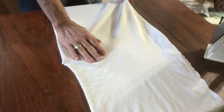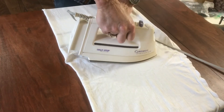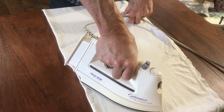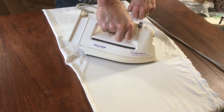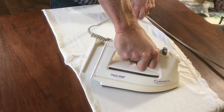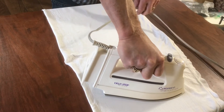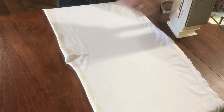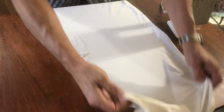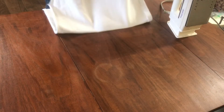Now this is the other table, and this is a different type of finish. I'm going to start at a medium speed on it, since I thought maybe we'd get closer to where I was on the other table. It was a pretty heavy water spot on this one, and we're making about half a dozen swipes on it. Now pay attention — when I pull this cloth up, you'll see it's actually starting to stick to the finish. You can see in the center where the cloth is kind of peeling back away — it was actually starting to stick to the finish.